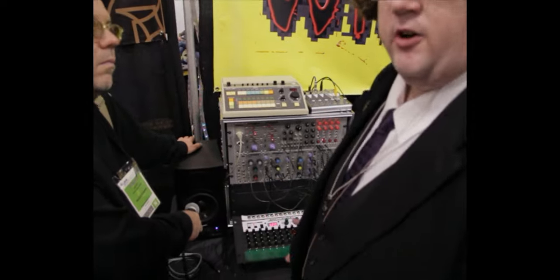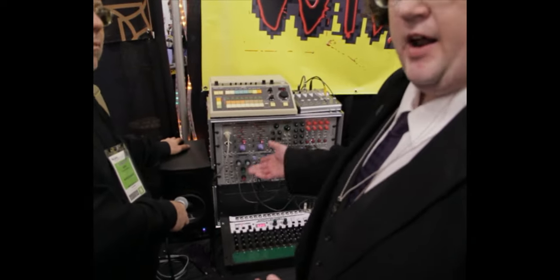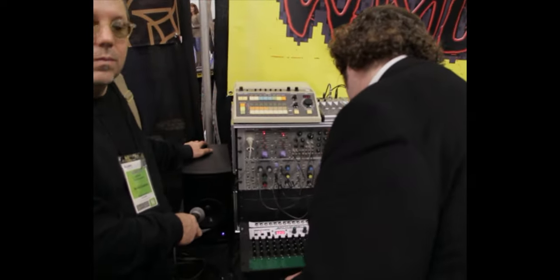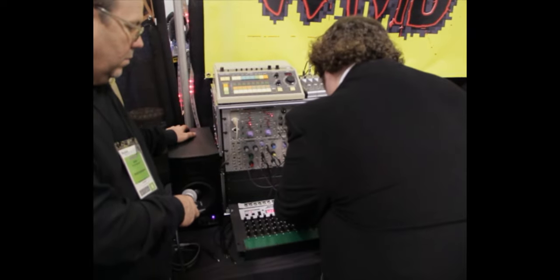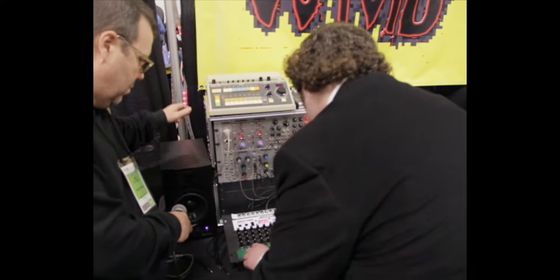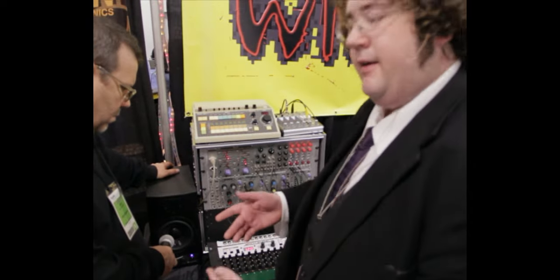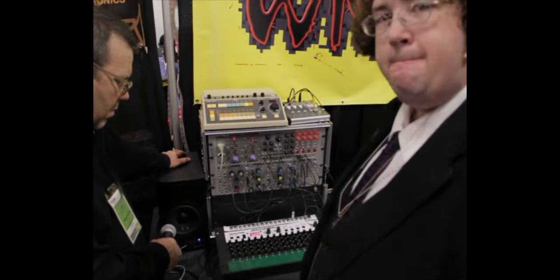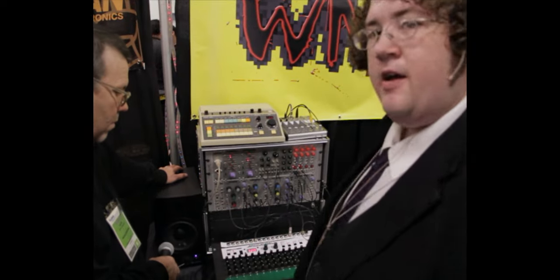It's an extremely musical instrument when coupled with an analog modular synthesizer. You can also use the sequencer — here we have an analog sequencer, zero to five volt output. But you can apply a quantizer to that output and then apply the keyboard scale to the quantizer. When the quantizer is engaged, the scale is limited to two octaves as opposed to five of the analog output.